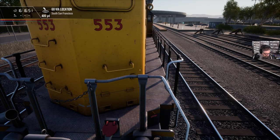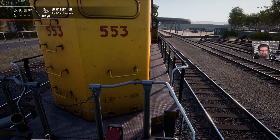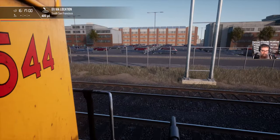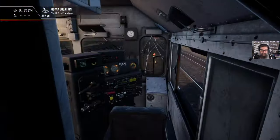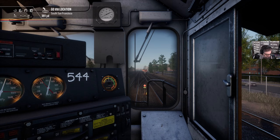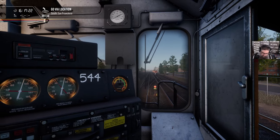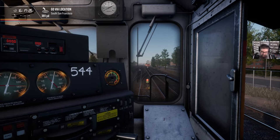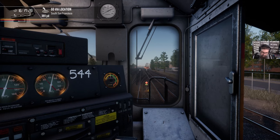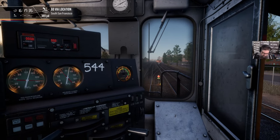The electrical and rotating equipment guards are in place — they'll be inside the engine bay and we can't see very much in there, so we'll take that as read. The diesel engine has no apparent exhaust, oil, water, or fuel leaks, and the handbrake is operational. The fuel tank is not leaking — this is a proper FRA sheet by the way. There are no defects or cracks in broken parts such as locomotive trucks, wheels, gear cases, and draft gears. The brake cylinder piston travel is sufficient to provide brake shoe clearance when the brakes are released — in our inspection before we would have made sure the brake shoes were clear of the wheels.